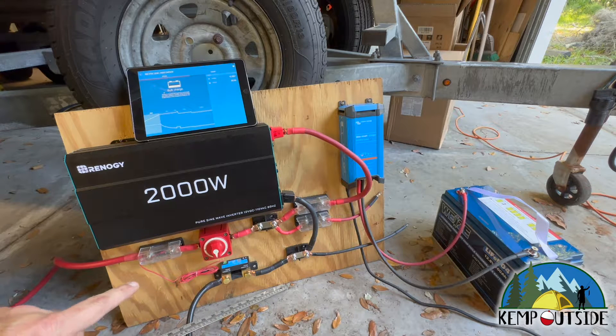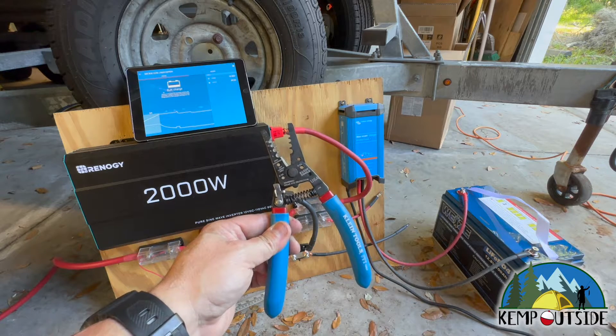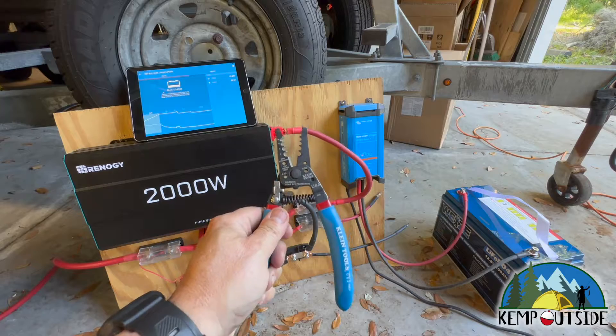You can create your own network so you can tie it in and it can get information from the Victron Smart Shunt, or any of the other Victron products you have. If you're running a Victron DC-to-DC charge controller off your tow vehicle or RV alternator, or if you have any Victron Energy solar MPPT controllers, all of those things work together and network together to share information. When you're using this charger as a standalone charger, you probably want to turn that networking off so you're not confusing the Smart Shunt. But if you're using it as part of a system, make sure you reconnect it. Also handy when working with cables — get yourself a nice pair of wire strippers for 6-gauge to 12-gauge wire, and a really nice set of wire cutters. I'll put a link in the description for those as well.